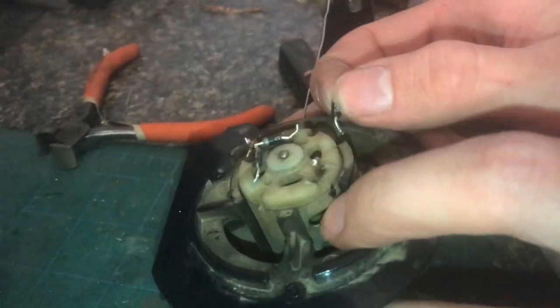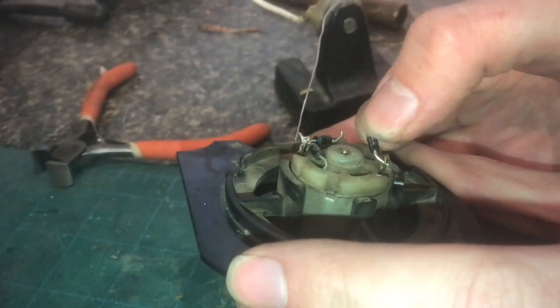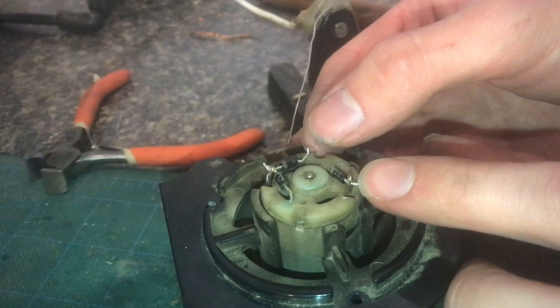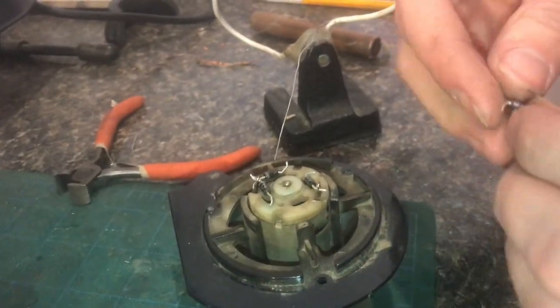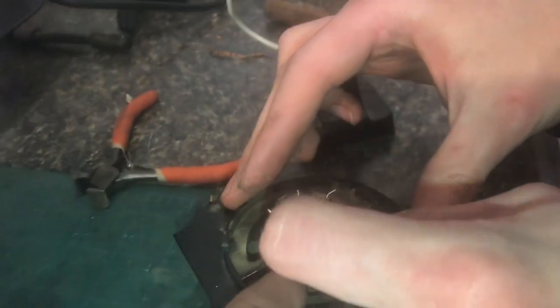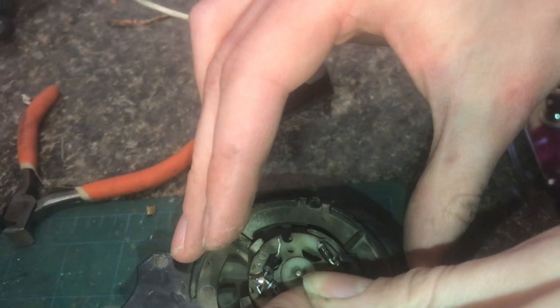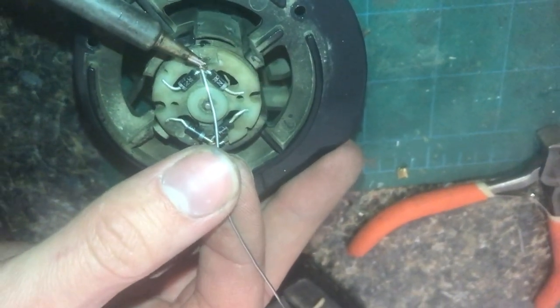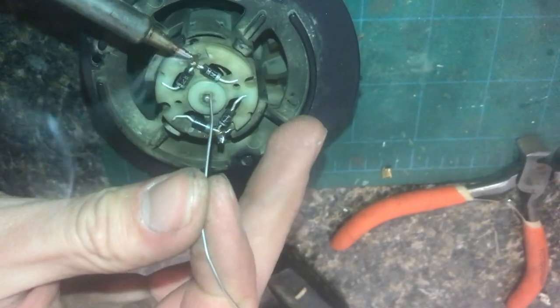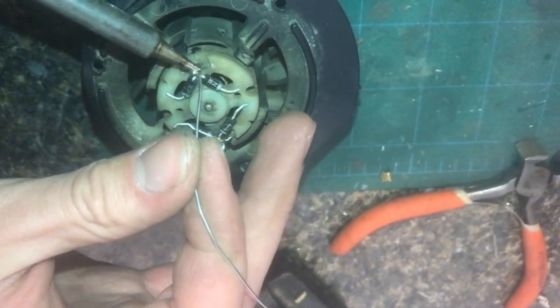For the negative side of the motor, the two diodes go with the stripe side facing away from the motor lead. I'm just going to put my iron on the motor lead and apply some solder and let it trickle down onto both diode leads. That went all right.